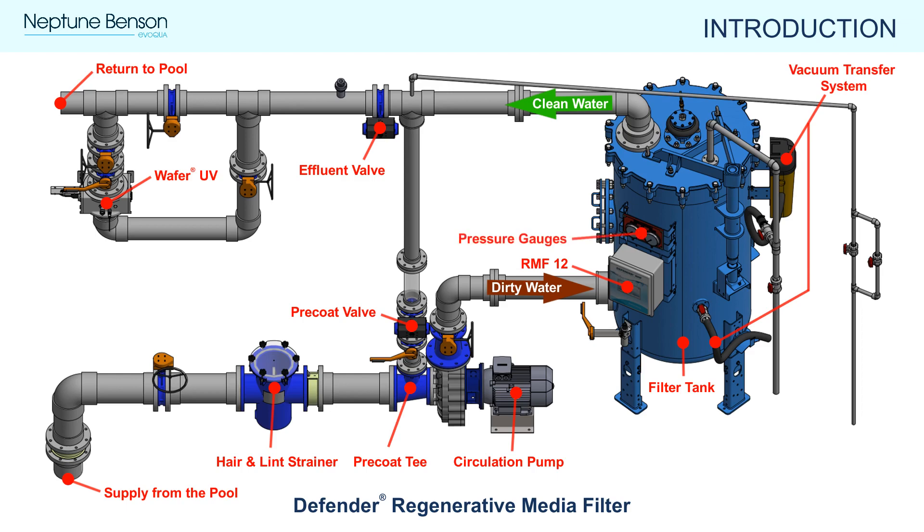The health and status of the filter can quickly be observed by noting the pressures on the influent and effluent pressure gauges. The integrated viewing window can be used to visually inspect how well the tube elements are precoated. There are usually two manually actuated air vent port locations — one generally installed at the highest point of the precoat loop and the other connected on top of the filter tank. These vents can be used to purge air from the circulation piping. The bump mechanism is located at the very top of the filter tank and is used to mechanically raise and lower the tube elements inside the filter while bumping. The tank drain valve is located on the bottom of the filter with a handle extension for easier accessibility.